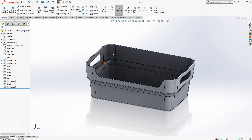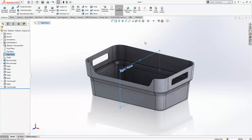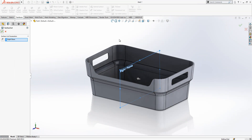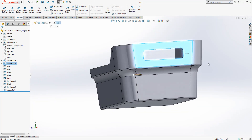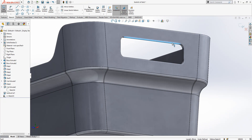In fact, we don't need the other half of the model anymore. We can remove it because we will have a lot of objects that we would like to mirror. Instead, we can just remove that half and only work with this area. Here I create a sketch — it's normal to this surface — and I'm going to convert this edge, right-click and tangency.